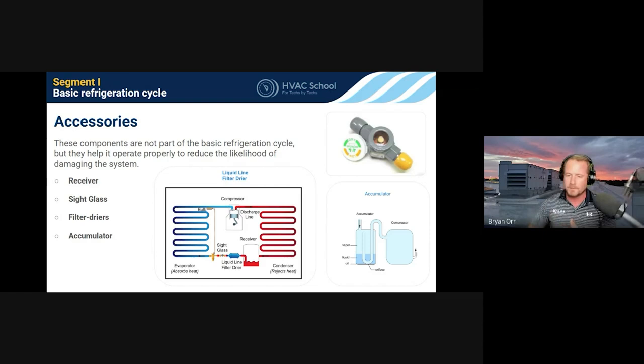That's why we don't want suction line dryers to be restrictive, and if we do have them in, we want the lowest possible resistance and remove them when they're no longer needed. That's why in residential systems we sometimes cut them out, or in grocery stores we replace burnout dryers with simpler ones or pull them out completely. Pressure drops on the liquid line are far less of a concern since the liquid is already at much higher pressure.